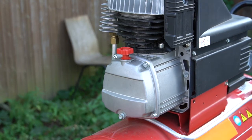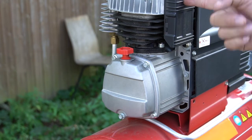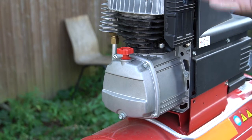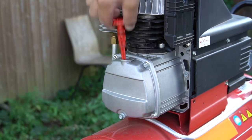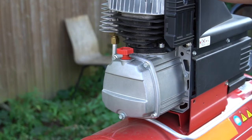Let's speak about maintenance. We don't have to do a lot on these compressors. The air filter — there's a screw, open it up, this is a simple air filter, change it or clean it so this thing is going to breathe well. Oil — it's like in your car. Check the oil, change it yearly. It doesn't matter if you have more or less running hours, simply change it yearly — you're on the safe side. It's like half a liter, costs a couple bucks, this is not really much. And this small body will be really thankful for every single bit of maintenance.